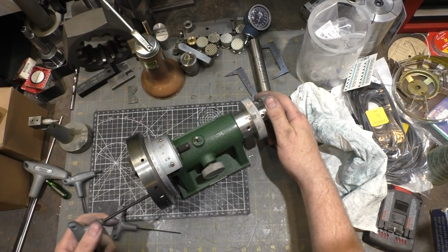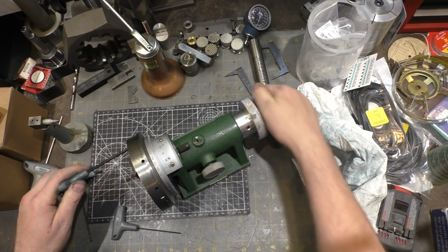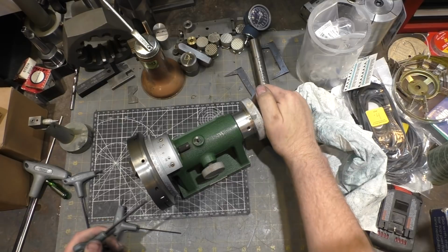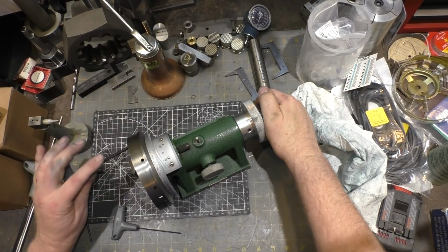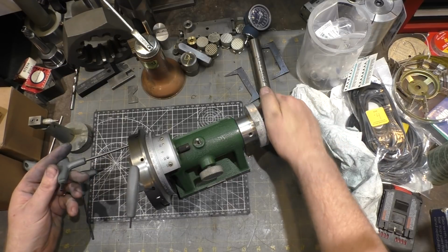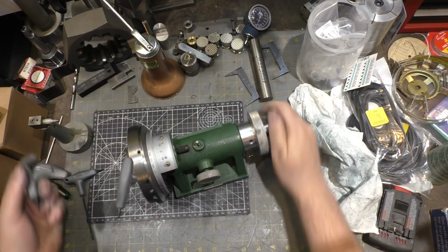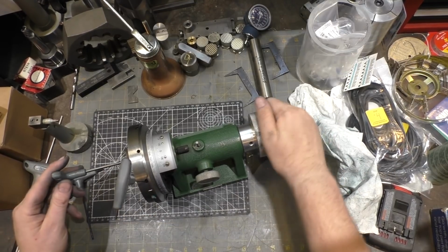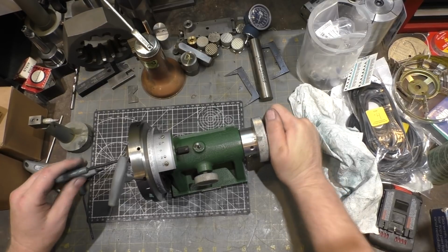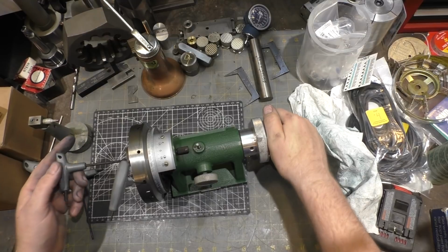And then these probably will shift a little bit as you tighten these guys down. Yep, because that's pulling the gib back and tightening that dovetail. You know, it locked it right off. I see, so they did essentially provide a lock for the motion in this direction, and that is this set screw here. Just crank that down and this thing does not move anymore. That must be what they intended with this design.